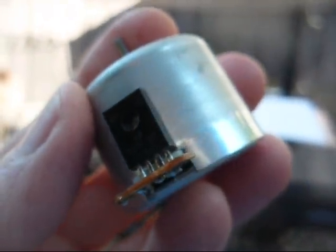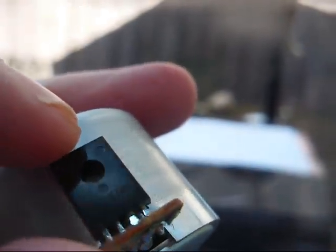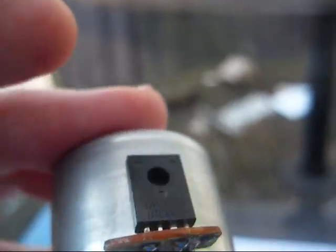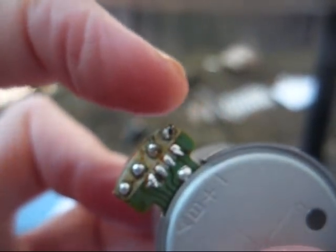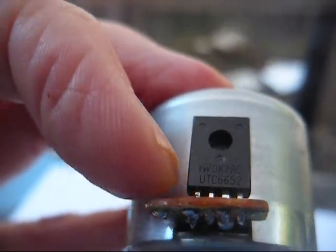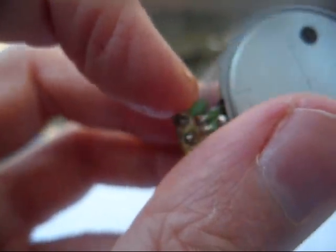Here's the bad motor out of that Audio-Technica turntable that we're going to redo. It's got a bent shaft on it, and I show it to you to bring up the orientation of the speed control regulator IC. On the older turntables, it's oriented so pin 1 is here and pin 4 is down here, and pin 4 is what you want to tack your 78 RPM pot to, the wiper from that pot to pin 4. But on this Audio-Technica motor, the IC is oriented so pin 1 is here and pin 4 is up here, so you want to pay close attention to that. And the easiest way to do that is pay attention to where the number is. If the number is visible from this direction, then pin 1 will be right here. If the number can only be seen from this direction back here, then pin 1 will be right there.